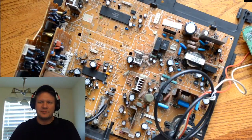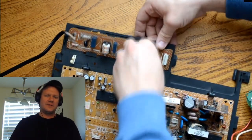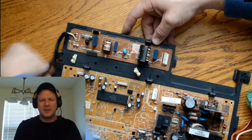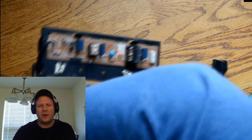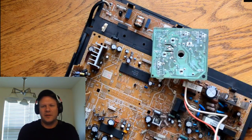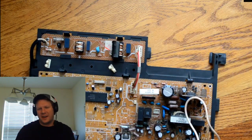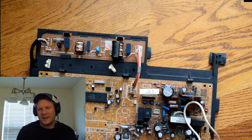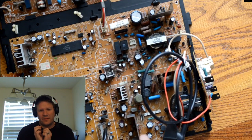And then you can use that black piece of plastic that goes against those inputs, and it'll securely hold those boards into place. And then last, there's the isolation power cabling and set up there. So, you've got your power input coming in there, and then you've got some Molex connectors here at the end to go back and connect together. And I like to connect as many of these things as I can while the whole thing is out, which there are a few connection points.